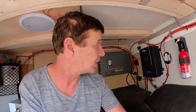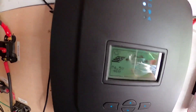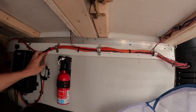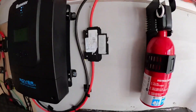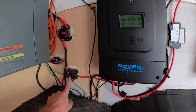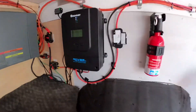The electrical cables come through here - they're all in series, so it comes in at a pretty high voltage. Right now I'm pulling 74 volts, gets up over a hundred. The cables come through here, the positive goes through this 15-amp breaker, comes up through here, out of the charge controller, hooked to this fuse here.